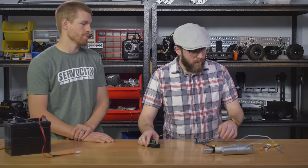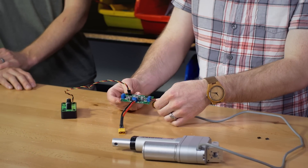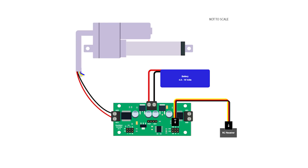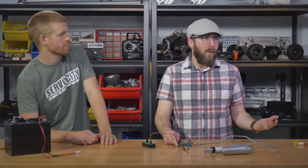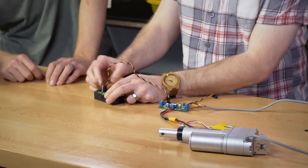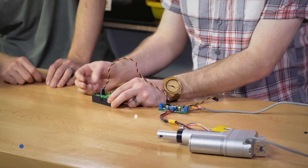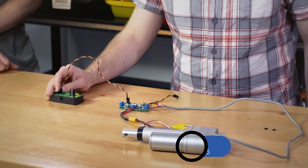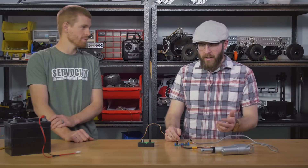In this particular case, I've got a 12 volt linear actuator here connected to an Actobotics dual motor controller. It's worth noting that in this first example we're only using the black and red wires, because those are the wires that are going directly into the motor to run it forward and backwards. I'm going to be in RC mode, or mode one, on this motor controller so that it's going to drive the motor based on the signal coming in on input one. That's going to be listening for a PWM signal like you'd get from an RC receiver, or like you could output from an Arduino or some other microcontroller. This is controlling the speed and the direction as I turn the knob here, using the Actobotics manual dual servo driver to create that PWM signal. So this is a slightly more refined version — you're driving the motor back and forth and you gain speed control as you do it.